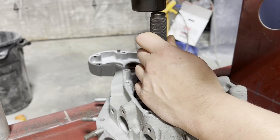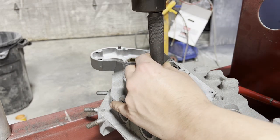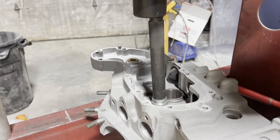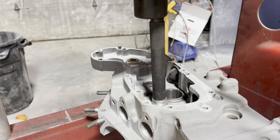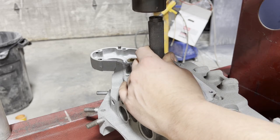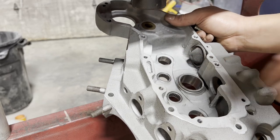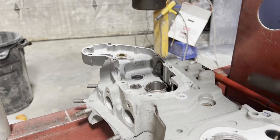It's a delicate game of trying not to go too far on this for re-tightening. Slide the case in just a hair, and the big part is just trying to keep this as straight as possible. The other thing you'll run into — bottom down on the case — I got real close to the lip for the thrust bearing or thrust washer. Make sure you're staying on the inside of this machined edge because you've got the thrust plate that connects these two halves, so you want to stay inside of those.